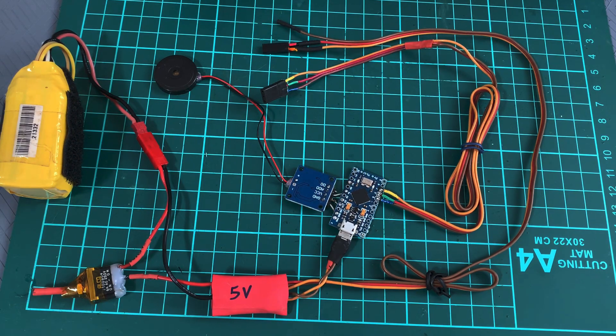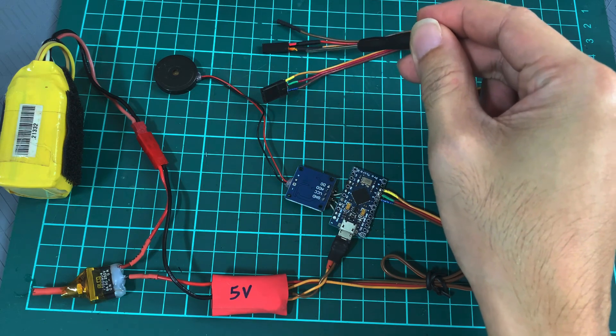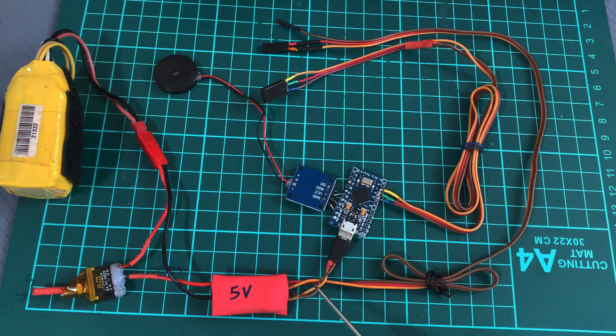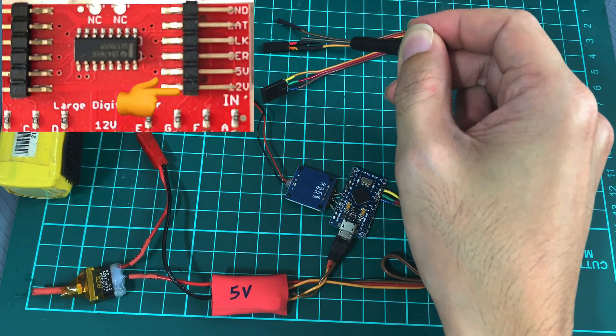This is what I came up with so far. Here we have the 12 volt supply going through a switch — when the switch is powered on we get 5 volts for the Arduino. The 5 volts also travels along the orange line to this pin here, which goes to the 5 volt input of the SparkFun LED driver board. There's also an unregulated 12 volt supply from the LiPo that goes along the red line to this pin, which supplies the SparkFun LED controller board.